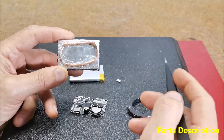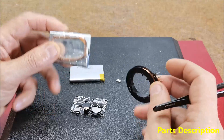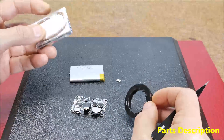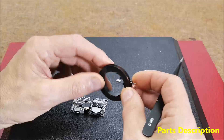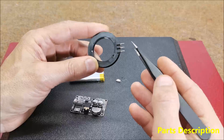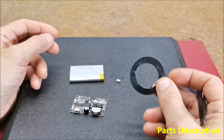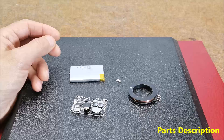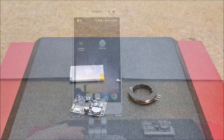When making this coil we should pay attention to recommendations such as: the DC resistance must be less than 15 ohms and it should contain 100 or more windings. If we use thicker wire, you need to wind more windings — the resistance will be lower, the field will be stronger, but the battery consumption will be higher, and vice versa. That's why we need to find a compromise between field strength and consumption. I recommend you use the coil I made.